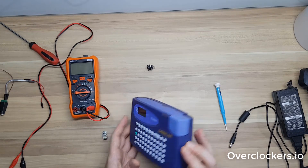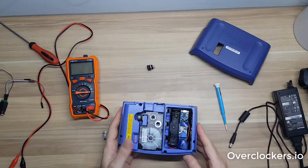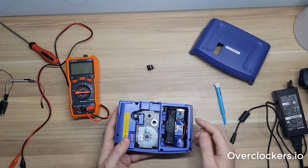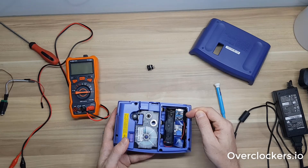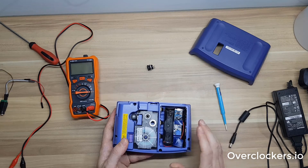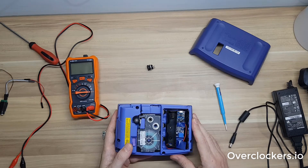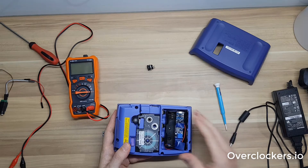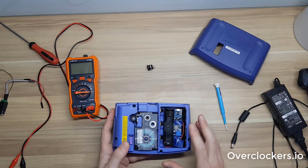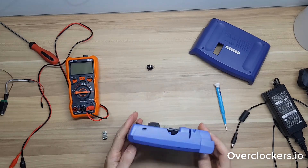What I did in the past is I opened it up and used one of my 18650 3.7-volt batteries along with a TP4056 and a boost converter to power it, and it was working perfectly fine. But I decided I wanted to make it so I can use a wall adapter rather than having to use one of my 18650s, because there's really no reason for this to need to be portable.